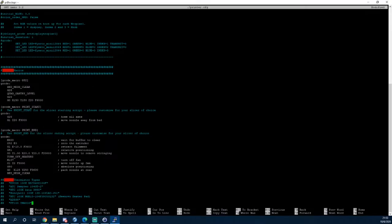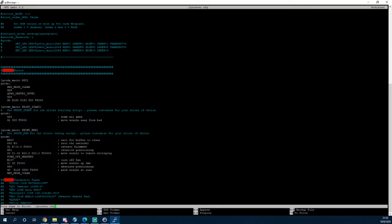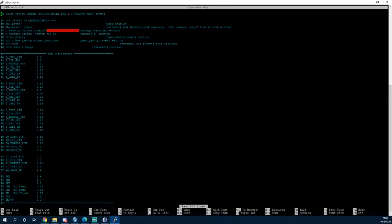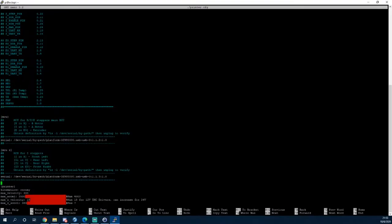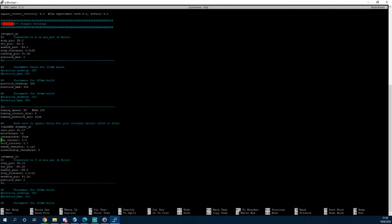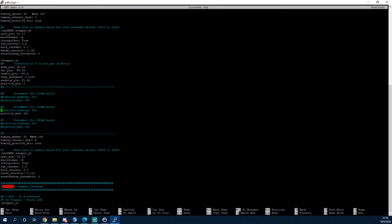Now, before we do anything silly, hit Control X, hit Y, save it. Now we can go back in here. Everything in blue is commented out. That's fine. Uncomment for 300 mil build. We need to uncomment those. Now we need to uncomment those under the X and Y.